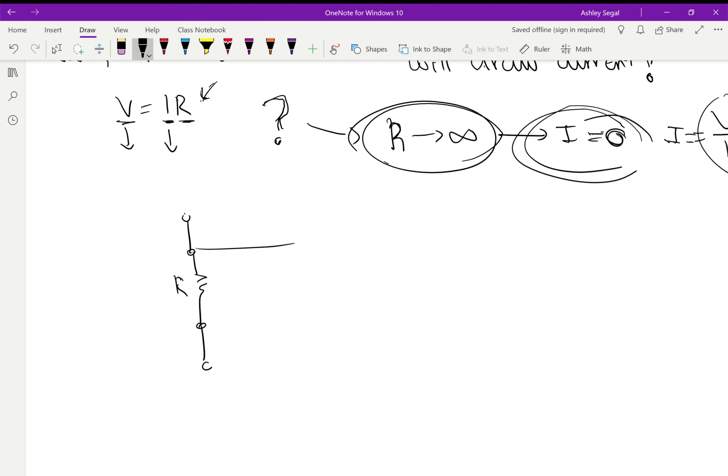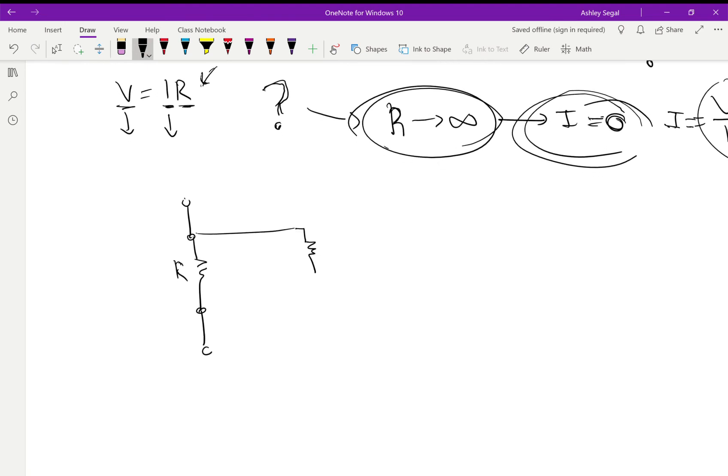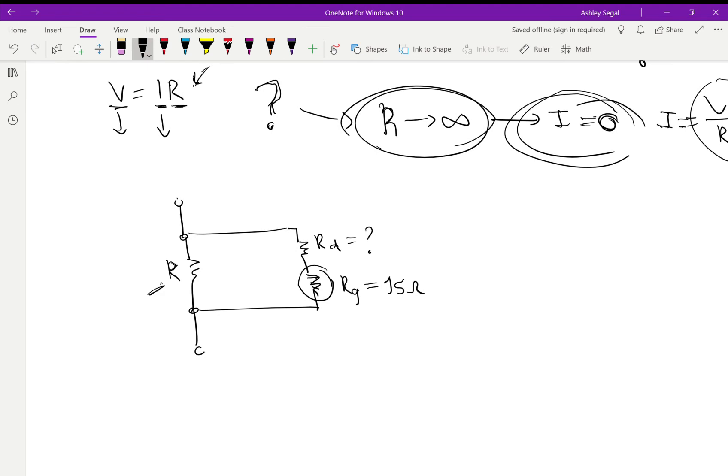So we'd have zero current — can your measurement instrument handle that? For our particular case, no. What did we have set up in the lab? We had a decade box and then our galvanometer put in parallel with whatever we're trying to measure. From part one we know the galvanometer is 15 ohms. If R was close to this 15 ohms with no decade box, our voltmeter would absolutely not work. We want to get this combination as close as possible to the ideal of infinity so it has minimal effect on the circuit.